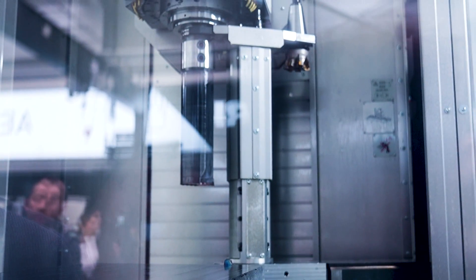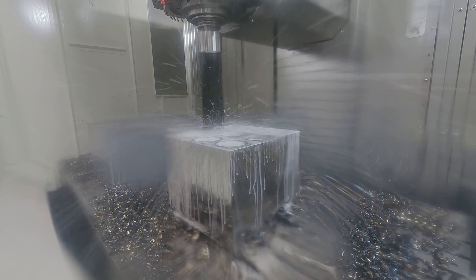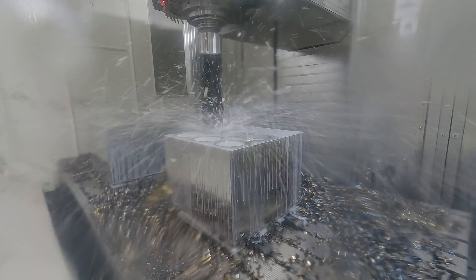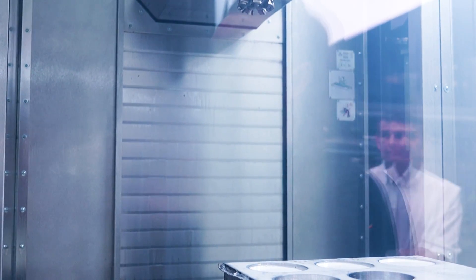Now this is really impressive - let's see this. How big is that? This is a 100 millimeter diameter drill going into full metal. You can touch the machine and feel nothing - it's like butter. There's literally no vibration at all. The Y-axis has extended quite a lot in performing this operation as well. And now we see the agile tool changer doing what we described earlier - all happening outside of the working envelope, so you avoid collisions and any issues with part placement on the table.